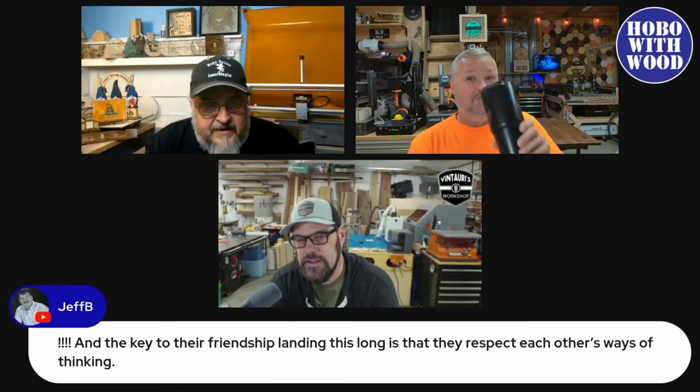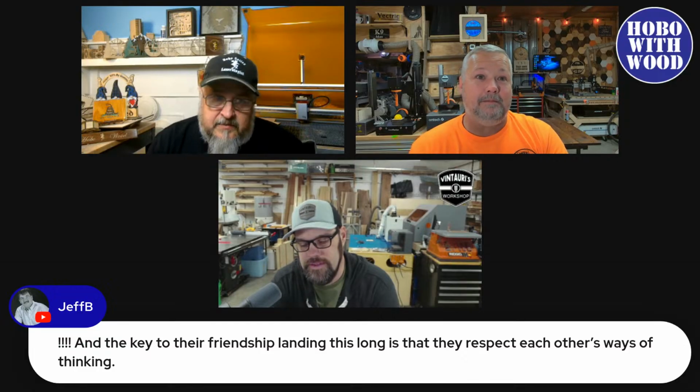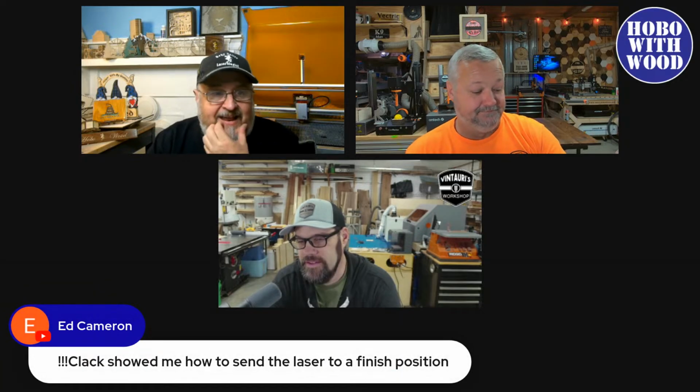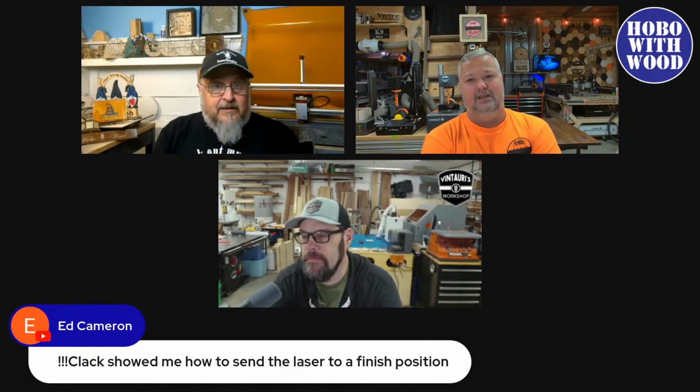Jeff there made a comment that says your friendship is a large part of why it's lasted this long, and your respect for each other's way of thinking. And Ed, this goes double for me. Clack is the one that showed me how to send that laser to the finished position, and that was absolutely necessary for me for repeatability on a laser without limit switches. Then I could send that out to that finished position, and I could send it right back out and do whatever. But even today with my Rolly Lasermatic XW, you see where it's parked right now? That's my finished position. I set up a finished position on all the machines, and I learned that from that fella in the orange shirt there.